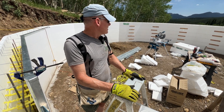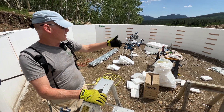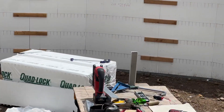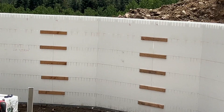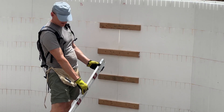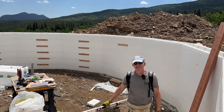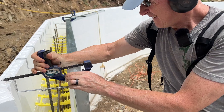Because of those common seams, I've got to put a little batten board across and screw that in to really strengthen it up. Then we'll have bracing butting up against that on the inside. If you zoom in you can kind of see that seam going all the way up without overlapping. So we'll have a piece of two-by-four that comes up here, and then there'll be a diagonal brace — braced to the ground all the way around on the inside and all the way around the outside. One little broken area and you're in trouble.